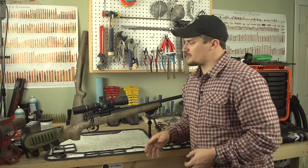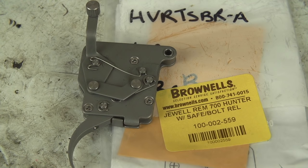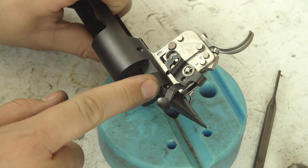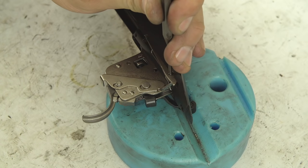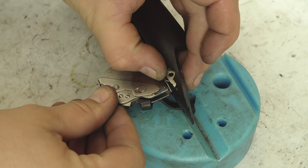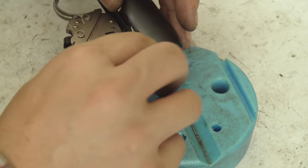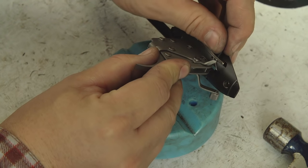As far as the trigger goes, we did replace the trigger. It comes stock with the X-Mark Pro from the factory, which is adjustable down to about three and a half pounds. However, we decided to use a Jewell HVR trigger — a fully adjustable match style trigger. I bought one from Brownells to put in my rig, and Eric shot mine. I have that thing adjusted down to like half a pound — it's ridiculous, almost like you breathe on it and you'll fire. To swap the triggers, there are just a couple of hardened pins to push out; you need to be careful to retain your bolt release mechanism and spring.